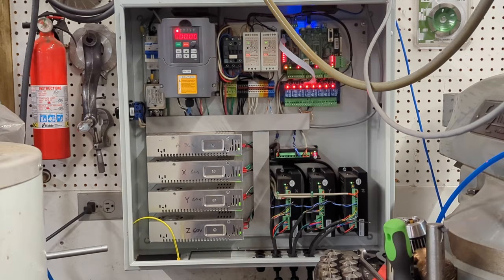About a year ago I put together this control board to convert my Bridgeport into a four-axis CNC machine. You can see up in the top right-hand corner there's an Acorn CNC Centroid Acorn board with the relay right below it. This cabinet has my power supplies, my drivers, my VFD, everything fairly well self-contained with a couple of fans up above.